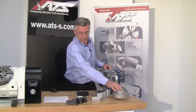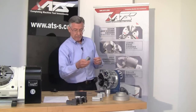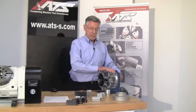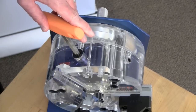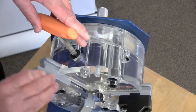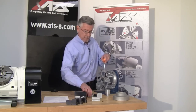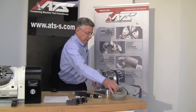For the second operation, you have your choice: we either have the bolt-on soft jaw that bolts to a master base jaw, or we have the monoblock soft jaw. With either of these jaws, if I properly bore the jaws one time, I can put them away and store them for days, weeks, or months, bring them back to the chuck, and we guarantee 5 tenths TIR concentricity putting the same jaw back in the same chuck. So if this was a finished diameter, you can grip on it, guaranteed 5 tenths TIR.